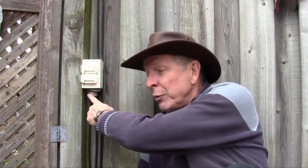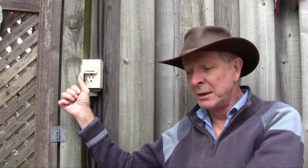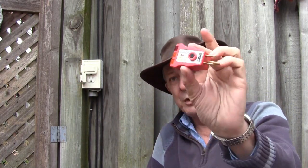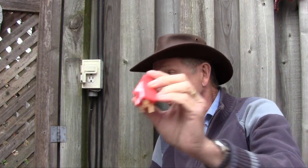I've put in a weatherproof box and I'm using weatherproof grommets for the cables going in to make sure that everything is watertight and safe and protected out in the backyard. This outlet is not a GFI outlet, but it comes off of one I showed you before which is GFI, so it's protected. Always use your testers to test your outlets.